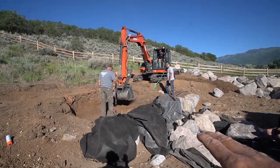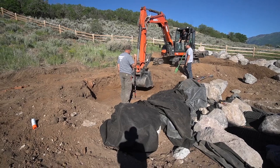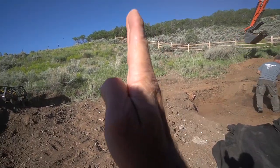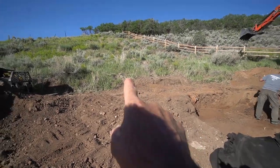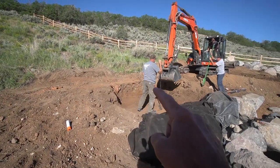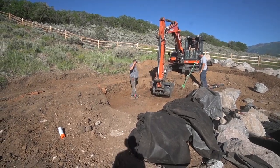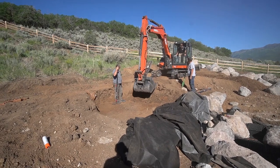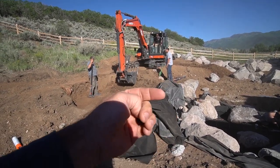Brian started this morning and the main waterfall is completed — starting up on the second one now. With a long waterfall system you don't want it to go straight from point A to point B. That works on a really steep slope where gravity takes hold and water comes straight down. But with a gentle slope and a series of ledges and terraces, you want a meander. We place large boulders into the hillside — in nature, moving water changes its course when it hits an object it cannot move. That's our frame rock, which will twist and turn the course of water. This waterfall faces almost dead-on toward the home; the next one we want to angle more toward the master bedroom.